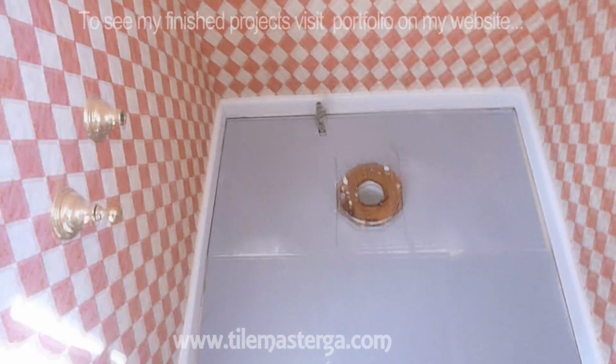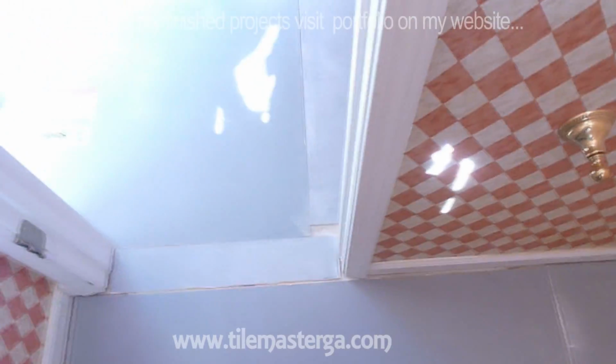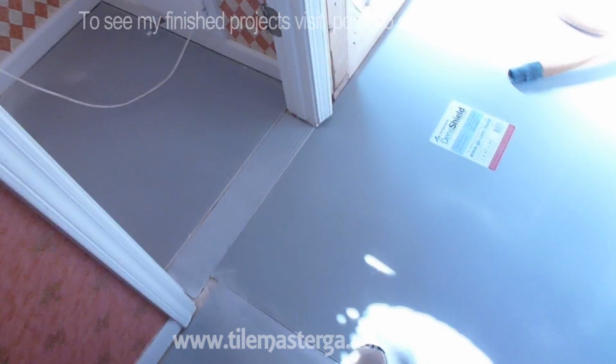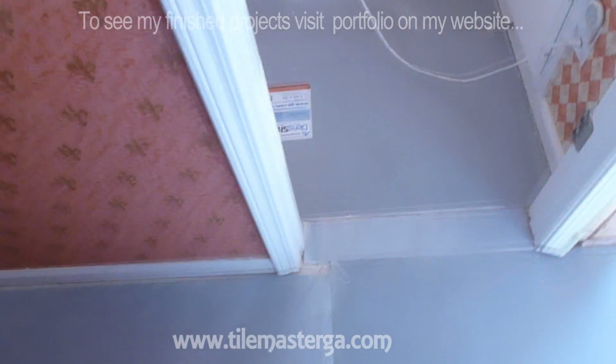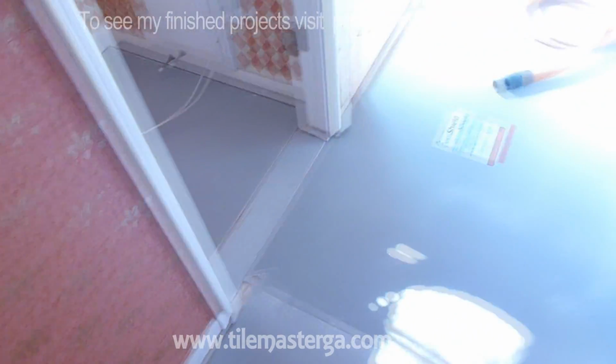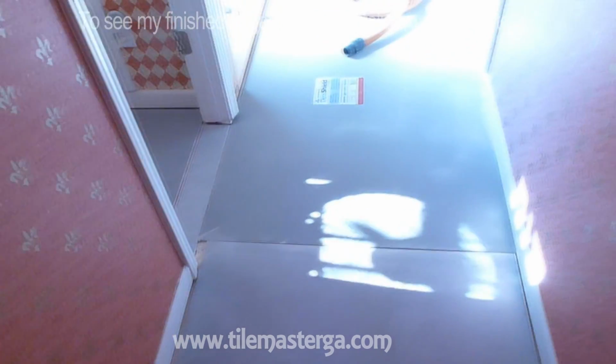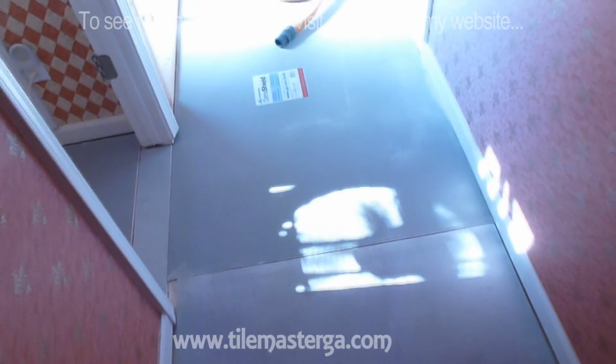Sometimes some contractors might tell you, well, we don't have to put anything because the floor is in good shape. It's not true. There are always some higher, lower areas, areas where the boards connect, some screws, nails. It's more about them saving time versus giving you good advice. The underlayment always has to be attached to the subflooring with a setting compound. The best product would be latex modified thin set. You can use liquid nails if you really want, but liquid nails will not fill the entire space unless you apply it with a trowel, like when installing hardwood floors, let's say gluing hardwood.